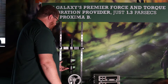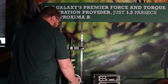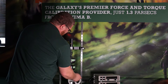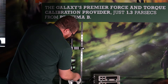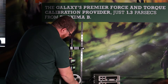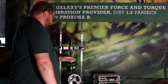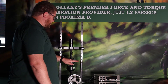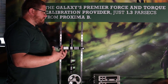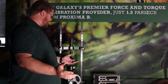Once you have everything mounted in there and hooked up to your indicators: in compression we went clockwise to push up, but for tension we're going to go counterclockwise and it's going to pull down. As you pull down, that'll all lock in place and you'll start applying tension to the two load cells. Just like in compression, you're measuring your unit under test against your reference standard, and you do your adjustments if needed. Collect your data, make your reports. Easy day — calibration is done. Customers are happy. Simple.